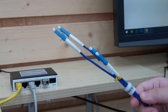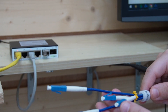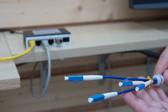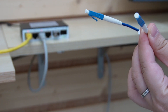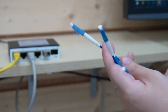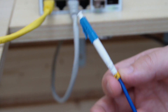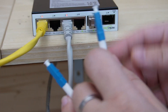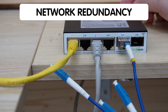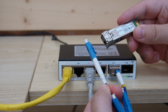So now I'm going to connect the fiber optic cable. I highly recommend using pre-made fiber optic cable like this one for the best results — less hassle and no need for splicing. And if you're wondering which fiber to choose, go for single mode fiber for long-distance high-speed connection, because it's ideal for point-to-point setups over several kilometers. Since this is a four-strand fiber optic cable, I'm going to use strand A. Let's plug it in. And for redundancy, you can also use another SFP module and add one more fiber strand.